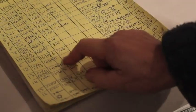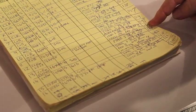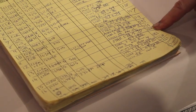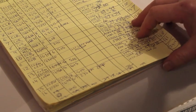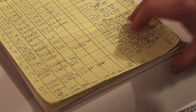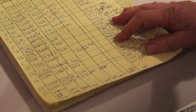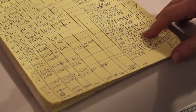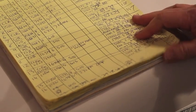Every day I record the power consumption, what color I melted, and how many items I made - 181 one day, 168 the next. I empty out the pot completely every day before charging for the next day. There are probably 150 of those sheets going back two decades. I've melted close to a quarter million pounds of glass through that furnace design since I built it originally in 2001, and it actually cost about $4,000 to build back then, including the price of the controller.